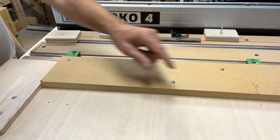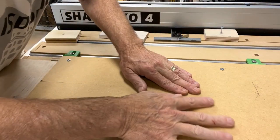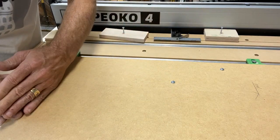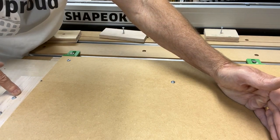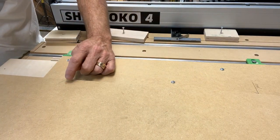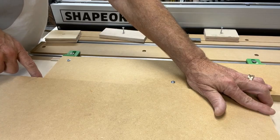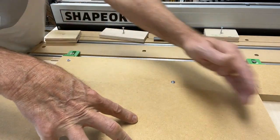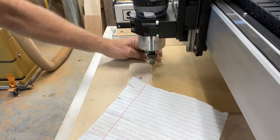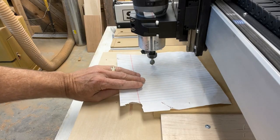So now I've got that reference point. I'm going to drop my workpiece back in here — everything's flushed, these line up perfectly. I'll finish clamping this in place. I'll cut tile one, then remove the stop block at the bottom, slide it down until this mark on the workpiece hits my zero reference corner, clamp it down again, and cut the second tile. Pretty easy, straightforward. I've chosen to use the manual method to set machine zero, using paper to set my Z.